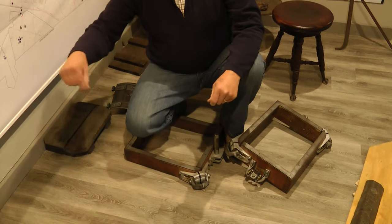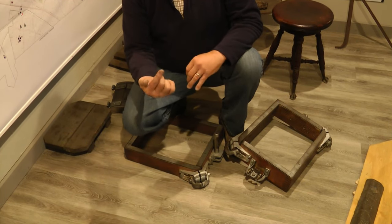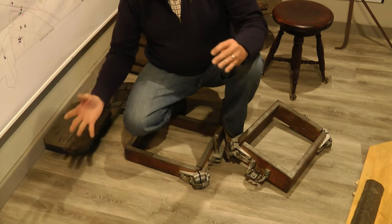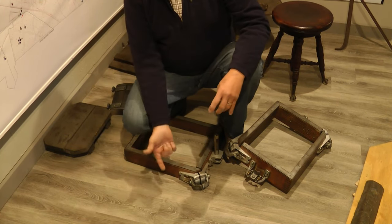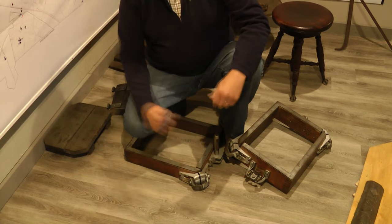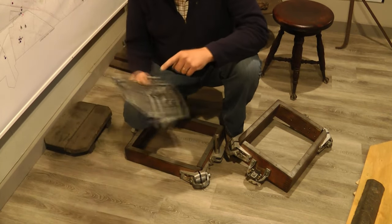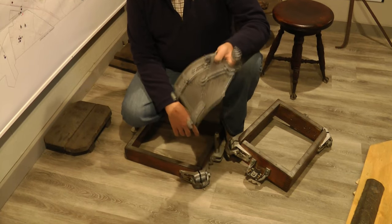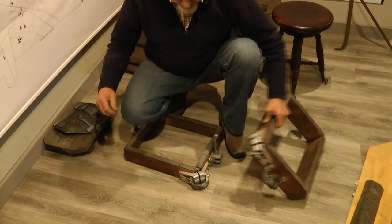And then they would pour the hot metal into it until it came out the other side, let it cool, and then break the sand apart. They'd end up with the piece of casting, very rough, with these stalks sticking out, which they called sprues. They would break those off and then do hand machining for the final item. Drill holes where they needed to, and then add the wrought iron pieces. So it was very labor intensive to make one of these stoves.